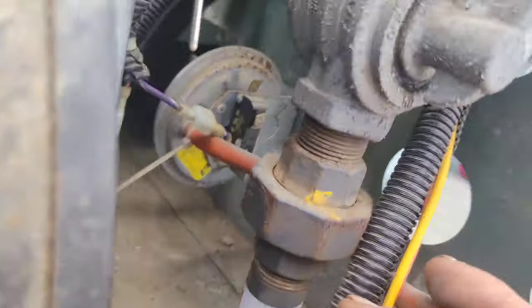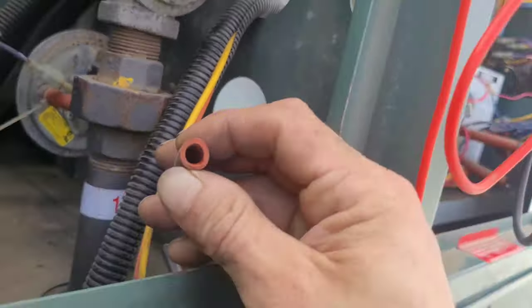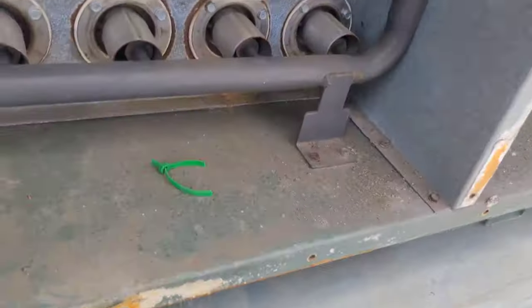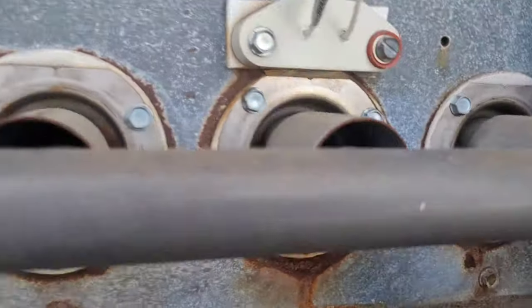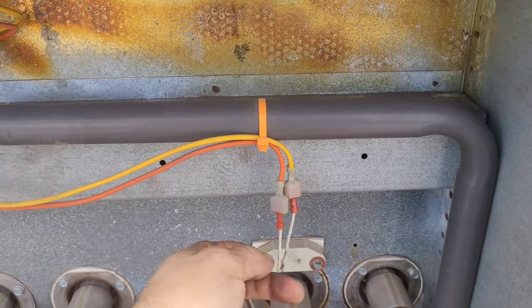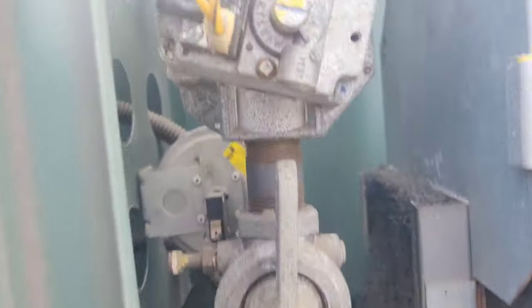This is the little hose that pulls a tiny vacuum through that switch. You can check it by sucking on it or in this case pushing on it. I pulled the cover off and — look what I found — a freaking igniter. So now we're gonna check that for high voltage; this one may also need to be working.